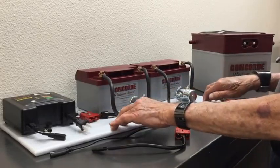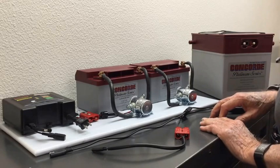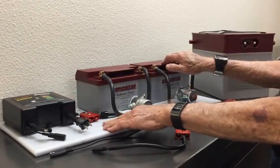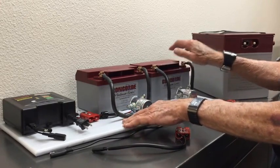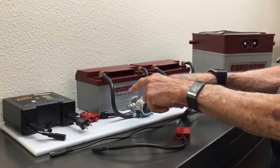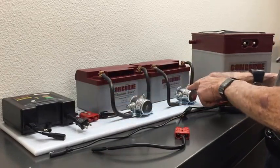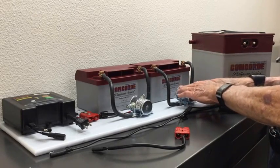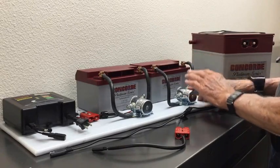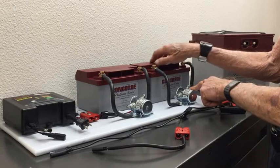This is a demonstration model of how the battery minder is used to charge batteries in an airplane. We have a battery minder mounted on a piece of plastic, which could signify a plastic airplane, with a couple of battery relays, two separate batteries — one battery relay wired with an Audio Authority enhanced flight quick disconnect, and one battery relay as it would be with a battery mounted on a firewall, underneath the seat, in the tail compartment, in the wing, or wherever the battery might be mounted.